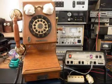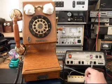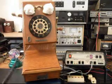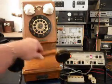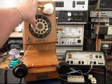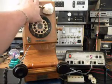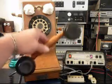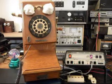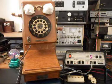Okay, so we know the telephone is fully functional and it's been repaired. Another thing that I want to do is go back over to the analyzer, and since the numbers are dialing out, give you some dial tone, we'll walk through them one more time. Pound, star, end in a 2. And now I want to transmit into the handset. If you watch this red light here on the analyzer, that red light is an indication of 100% modulation on transmit.